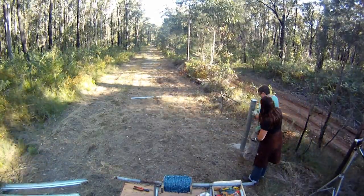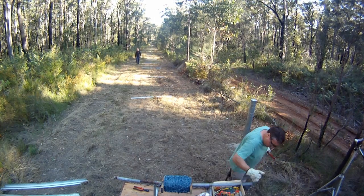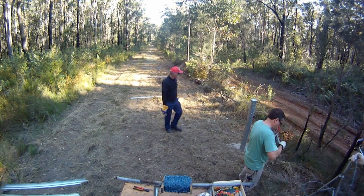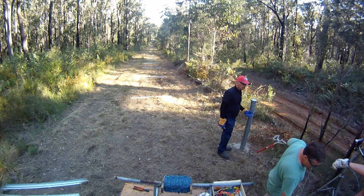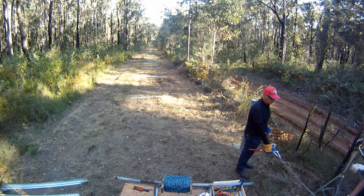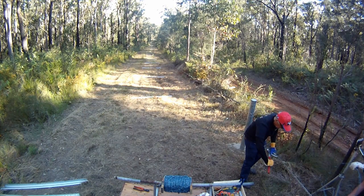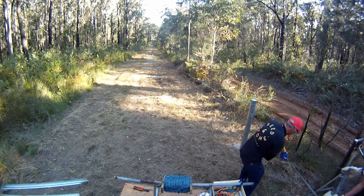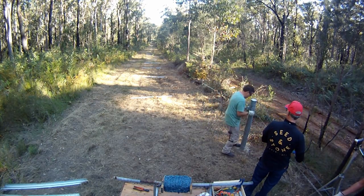Short length of plain wire on the intermediate post to set up the second chain strainer. These strainers work by walking jaws along the links in a chain. I didn't get any footage of it up close, but I will no doubt get some on later fences.